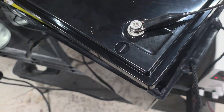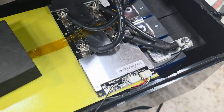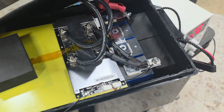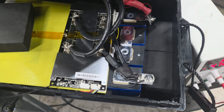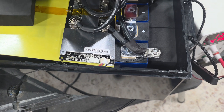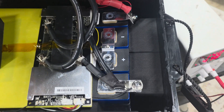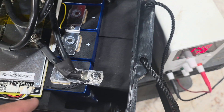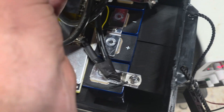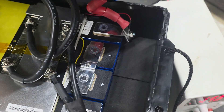I popped the top off the battery, which wasn't too hard. I have it on the charger right now. The BMS is just kind of sitting on this fiberboard here. It's got welded cells — all the connections are bolted and laser welded. The wires up to the negative and positive terminals are pretty secure. The negatives are two number sixes, and the positives are number two.